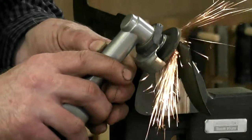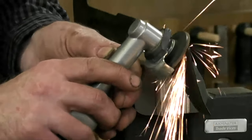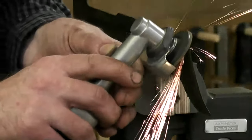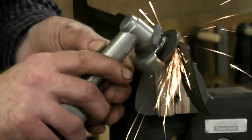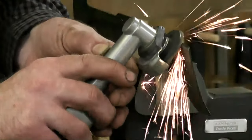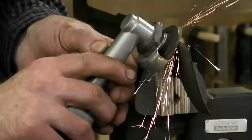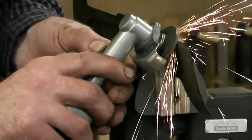Look at the beauty of this, it's the size. It's compact, there's no weight, it's not heavy, it doesn't drag it down. Easy to control with smaller discs. Trying to get a big chunk I've got out near the top, so nearer the boss. Blend it in. Don't need loads of pressure. It's running nicely, we're not draining the motor, so nice light pressure will help.